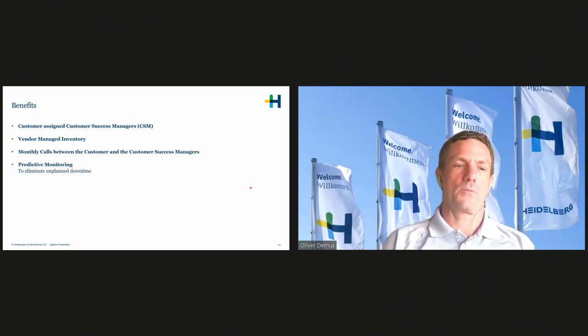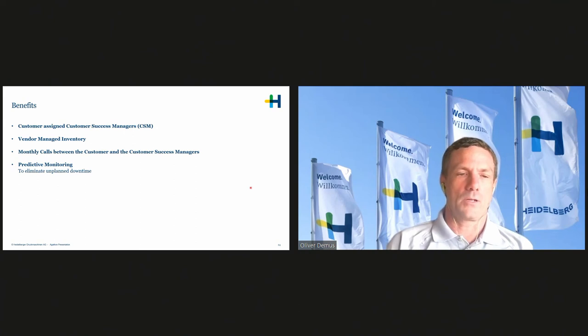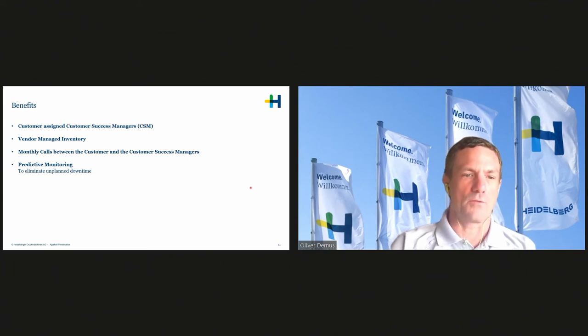Predictive monitoring to basically eliminate unplanned downtime. We have tons of sensors in the press which report on a daily basis issues which could occur on the press and will show us, well, device ABC might fail within the next 2 weeks. So then we can turn it from unplanned to planned downtime, and that reduces time in the downtime. So in the end, the customer has more time for production.